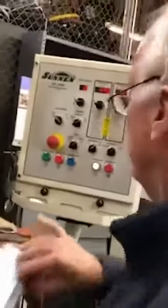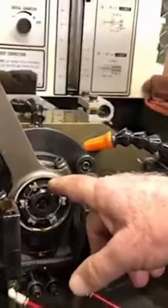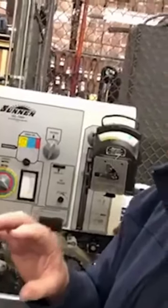Look at that. These are 5'7 length, and they're both like a journal. These machines, we use nothing but diamonds — industrial diamonds that we use for honing the size. And what that gives us is absolute sizing control as far as roundness and taper and the center-to-center distance, as well as the parallelism.